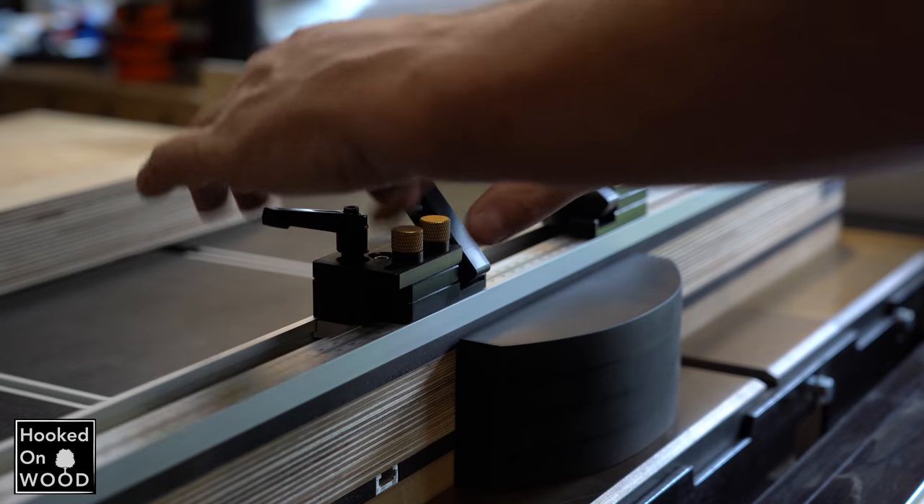The second one is this black clamp. It has a back foot that you can change in height — this one has 3 levels, but you can also get them with 5 levels. By changing the level, you have a longer reach, almost the same as with the former clamp. I tend to like this solution over the former clamp. Because of this mechanism, the clamp is not that big but has a good reach, and because of its smaller size, it is better usable on a drill press platform. Its clamping force is very good — 100 kg of pressure is suitable to handle with this clamp. I like the build quality and material use. This would be one of my favourites as a clamp for your workbench top because it has a good reach and enough clamping force. Compared to my rail guide clamps combined with dog holes, which end at 50 kg, these clamps can provide some real pressure.